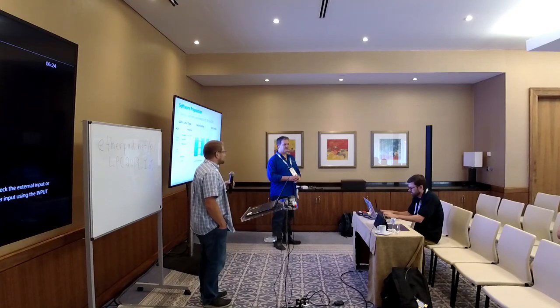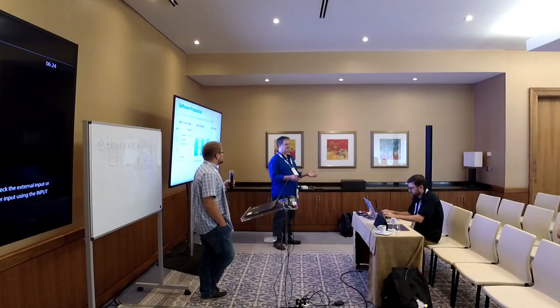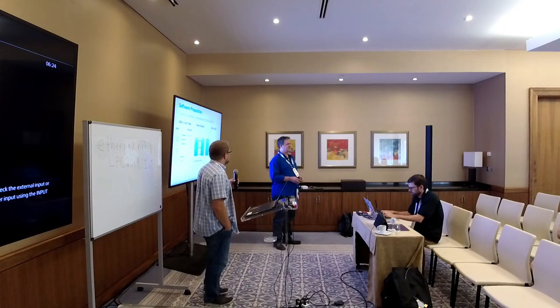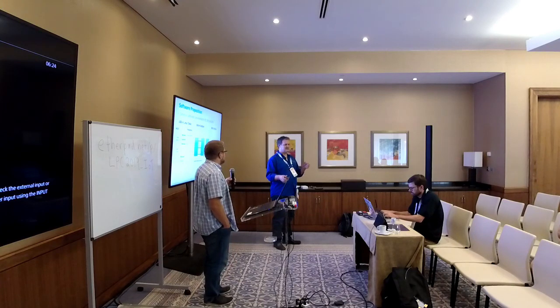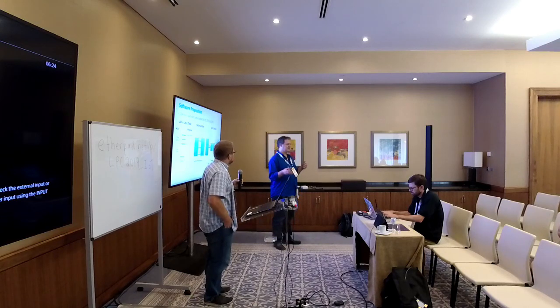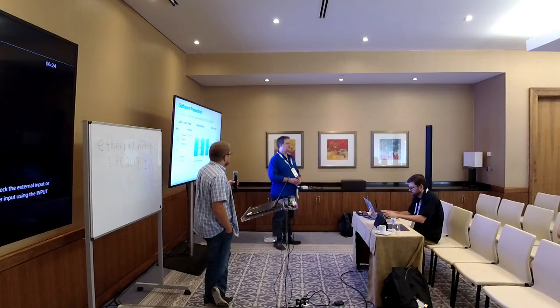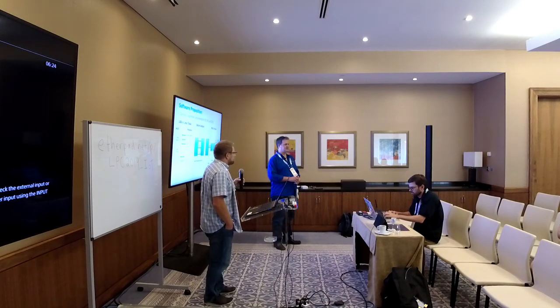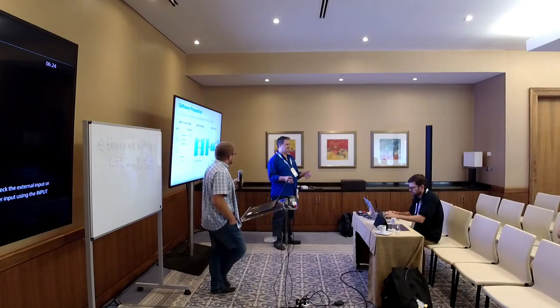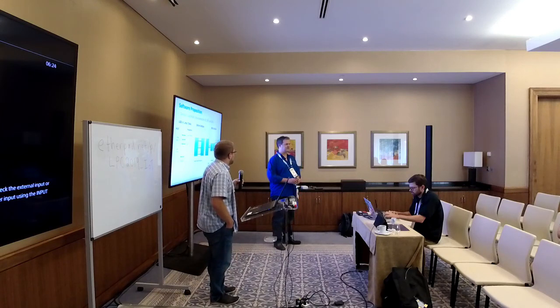But you know, if you want a random I2C IO driver, you're gonna need to provide some additional platform data. That's why I think using something like the mikroBUS stuff is good, where it's got a full enough set, and also a simple enough set, that if I want an interrupt, I've got a particular IO pin defined for interrupt. And that can be remapped in a platform-specific way within the implementation and hidden from what we do for all the Greybus device drivers.